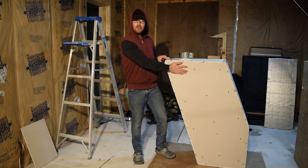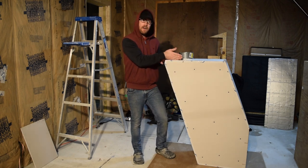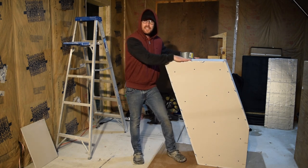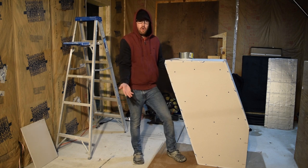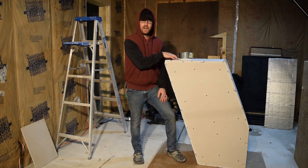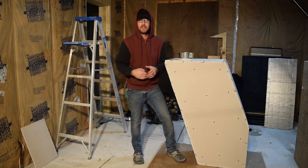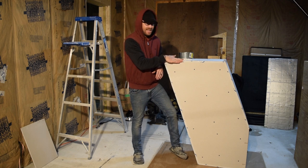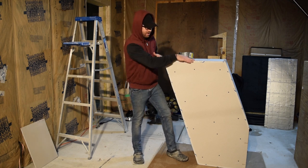Since then I went ahead and added another layer onto each baffle box — this is 5/8-inch drywall. So now the baffle boxes are half-inch plywood with 5/8-inch drywall on them. Adding the 5/8 drywall increases the mass and density of each box, which allows less sound to escape through the walls. Sound and air are both coming through this box — we need to minimize the sound and let the air transfer. For every joint I added acoustic caulking just like on all the plywood joints, and I added Tyvek tape on each seam really just to clean it up and hide the live edge of the drywall.